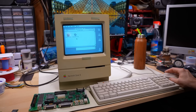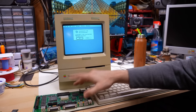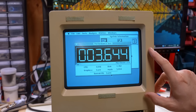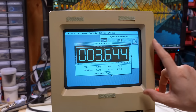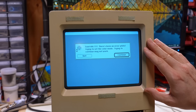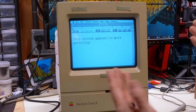I'm going to run Speedometer 3.06 on this exact System 6.07 on all three of these machines, just so we can compare actual performance metrics. We have a CPU score of 4.046, graphics of 3.641, disc of 1.702, and math of 5.934. I've noticed the performance rating can vary depending on what Macintosh system software you're running, so it's best to compare across the same version. For reference, here's the same blue SCSI boot image running on the Mac SE with its numbers. I'm going to do a jump cut and run some performance tests and games, just to make sure this machine is actually working properly. After some gaming and applications, everything appears to be working perfectly on this Macintosh Classic II.